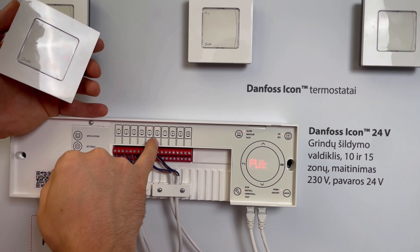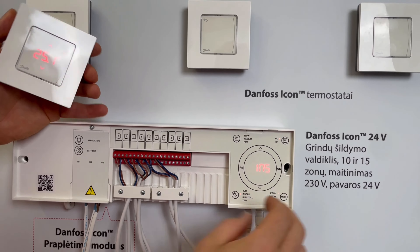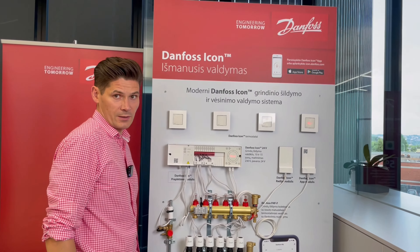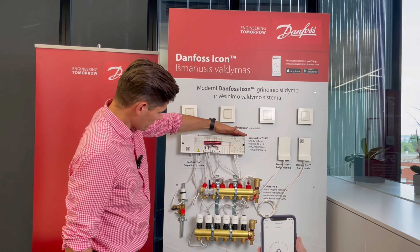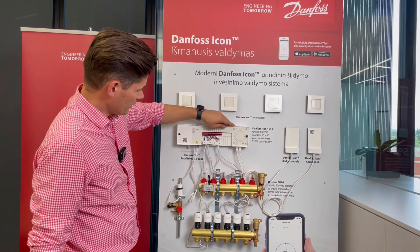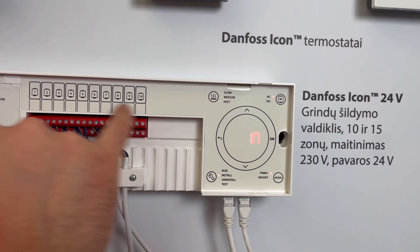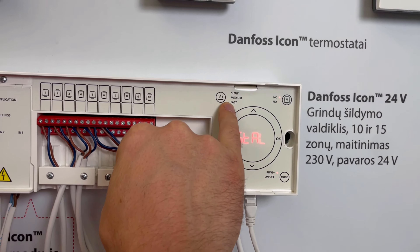So I have to know which circuits are in this room — let's say room number one, circuit number one. I push it, so one is not blinking and the rest are still blinking. If I need to connect two actuators to room number one, I select two actuators for room number one and then push OK.